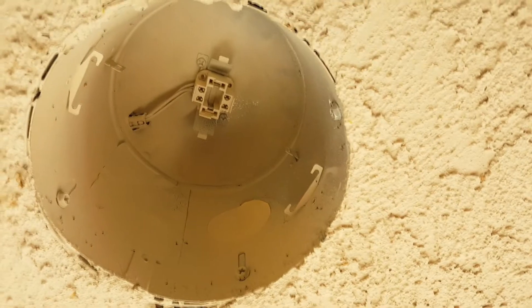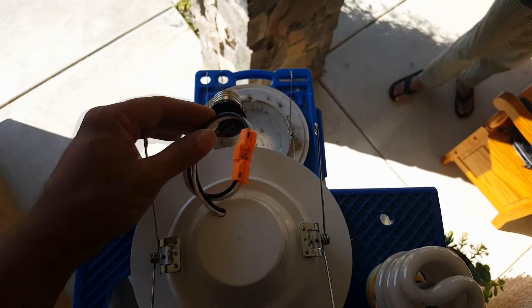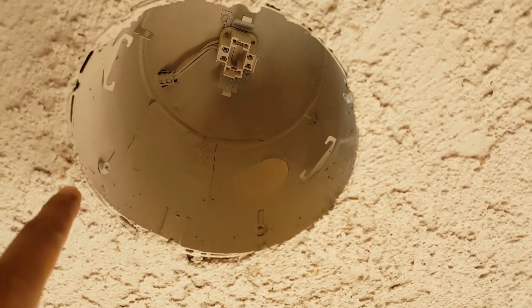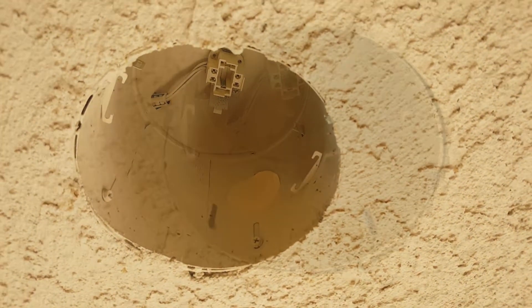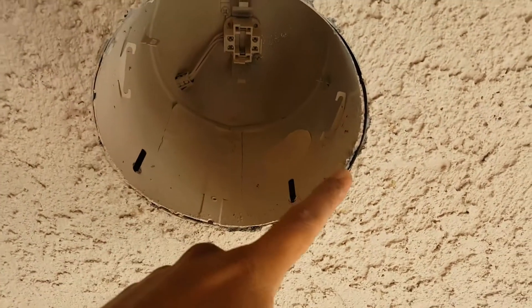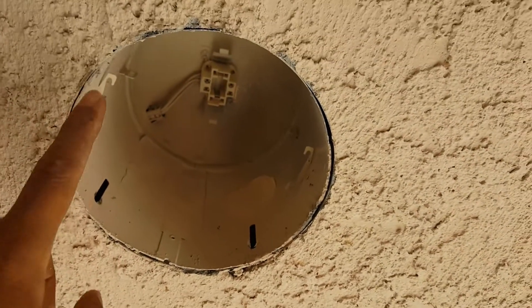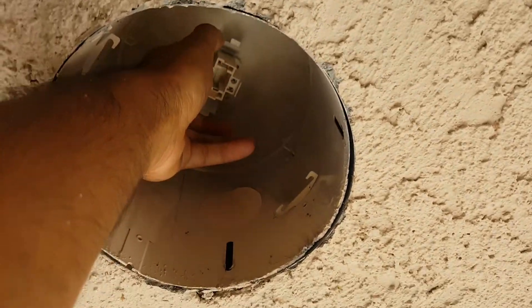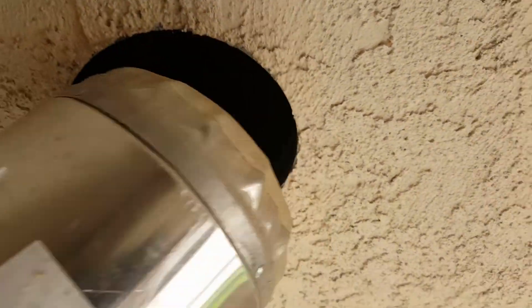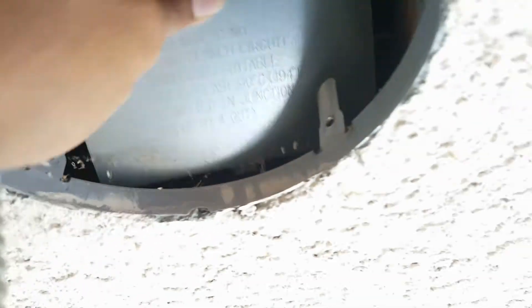So I'm just going to convert it so I can plug this in directly. I'll get started by removing the can and go from there. Now that I've got the screws removed, if it's stucco the stucco may overlap, so you may have to push this upwards, getting rid of the stucco around the openings, then reaching up and pulling it through just like that. It should dangle by the wire.